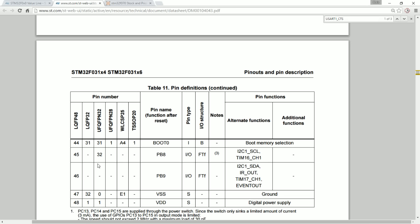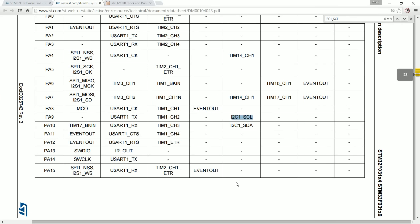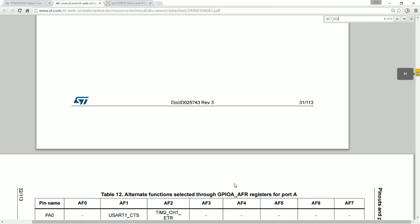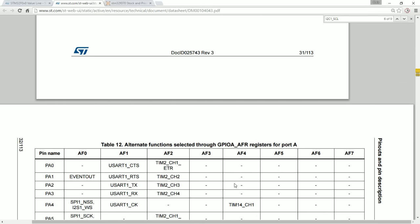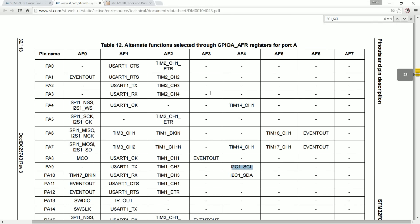On smaller packages you might get away with I²C and UART, but UARTs are more likely to be sorted between pins than I²C. It's not because I²C is hard silicon — it's because people are more likely to use UARTs. With I²C you just use one bus and connect multiple devices, whereas with UART, like I mentioned for debugging, it becomes a second choice and people want to move it to whatever pins are convenient. So they'll lay out the I²C first and then sacrifice the UART to whatever pins they want.